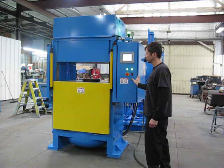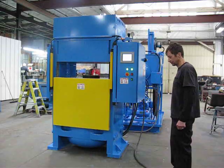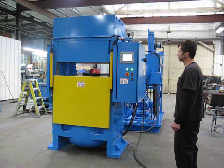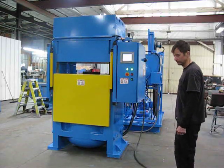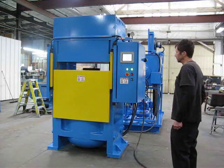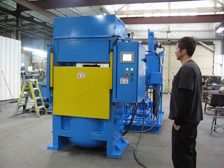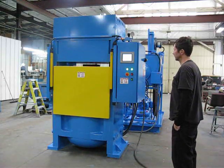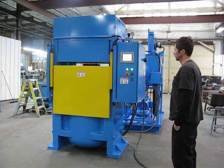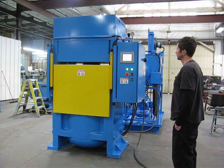Right, go ahead. This is a 530-ton slab side press. Got new controls, new hydraulics. The press is now moving up in fast close. We're going to run it through a full clamp cycle, which the minimum time setting is 90 seconds. So once it clamps up here, still it's in slow close right now.